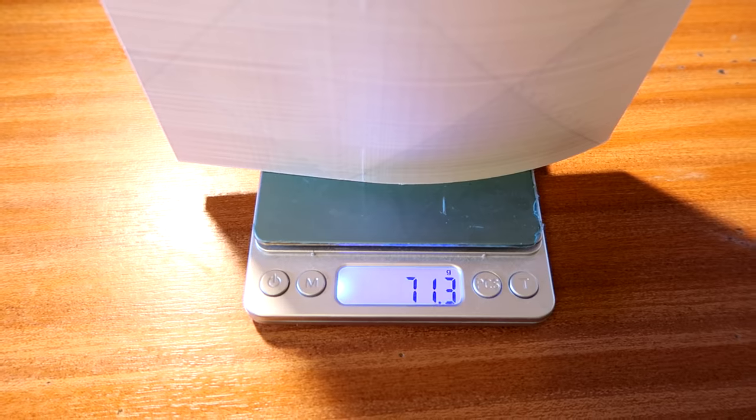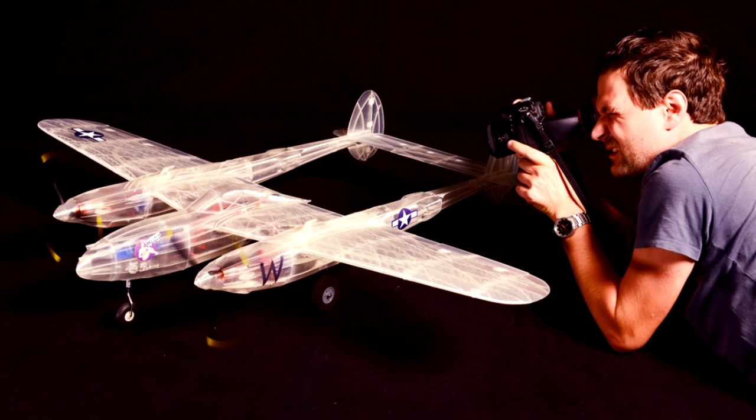After five hours of printing, this is the result: a 20cm long 3D printed wing with a one-layer thickness skin on the outside and a cross-section rib through the centre. The weight is about 71 grams — a huge saving on the previous one, especially since this printed the full 20 centimetres. Because the previous example was 75% the length but 20 grams heavier, this actually achieves a 41% weight saving from having the single-layer outer skin. The P38 Lightning printed by 3D Lab Print used clear filament so you could see all the architecture inside, and it also had circular cutouts in the ribs, which will be the next stage.